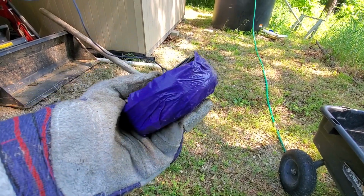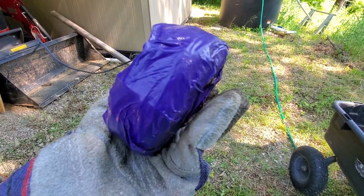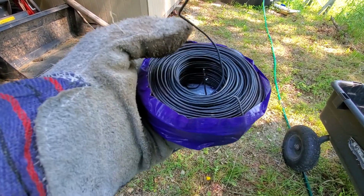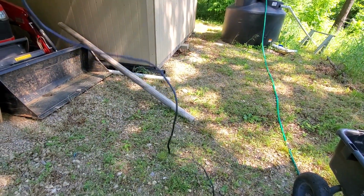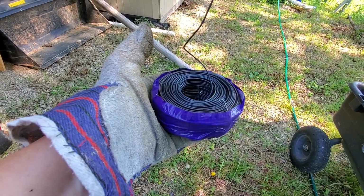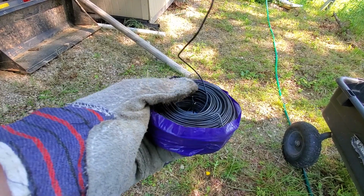I had a guy tell me a long time ago, if you wrap it in duct tape, that makes sense, across the bottom and across the sides. And when you snap those wires, you make sure you pull it from the inside. Does that make sense? And it doesn't unspring, it doesn't unravel, it doesn't get all twisted. And you can pull out the length you need, cut it off, leave yourself a little tail to pull off the next.